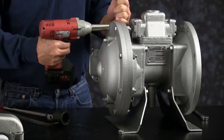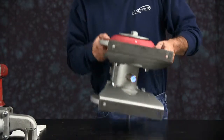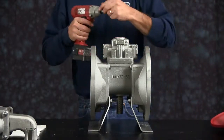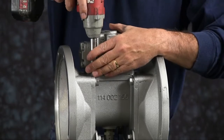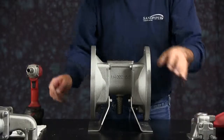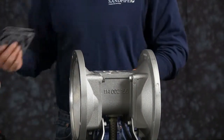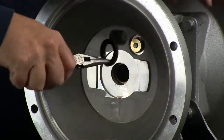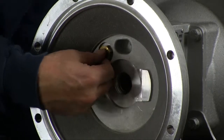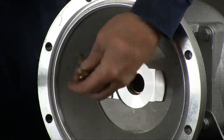Then go ahead and take the opposite chamber off. Set the chamber aside. Remove the diaphragm assembly. Set the bumper aside for use later. We'll take the air valve off next — take the four bolts out. The gasket you can discard. You have the pilot valve underneath; go ahead and discard the pilot valve too, and then the final gasket. Reach inside the inner chamber — with a pair of needle nose pliers, pull the U-cup seal out. Do that on both sides. Then push the actuator plungers all the way in on both sides where the bushings are so you can get a socket or wrench on the bushing and remove the whole assembly. You can discard that.